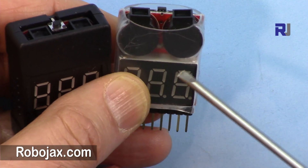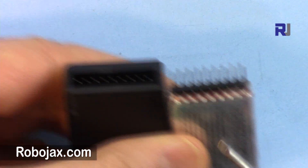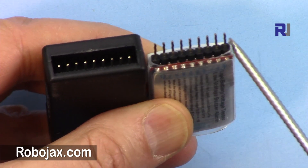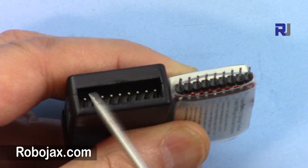So you can set your own values, and when you fly your drone or just test the battery the voltage reduces and this will make a buzz. Here we have connections — this is common, and then this is for cell 1, 2, 3, up to cell 8, so we have 9 pins here. Same thing on the other one: that's ground and then 8 pins for 8 cells.